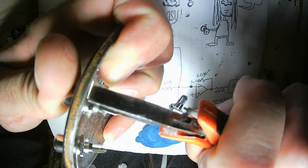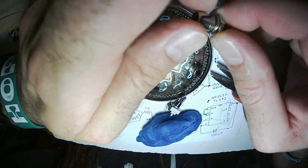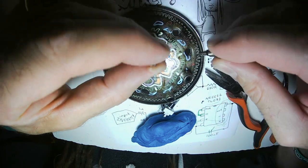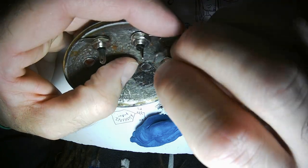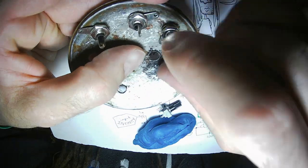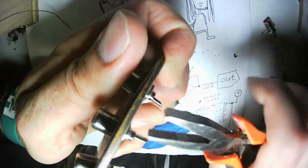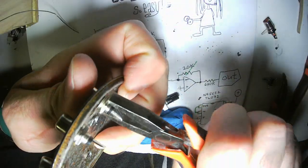Now, one of the cans I used three times was a pickled herring snack can. Those are made of aluminum, and aluminum is very thin and doesn't really work in the same way as steel. So when I put the jacks in the aluminum, it ended up being very loose, very quickly. The jacks kind of became wobbly. So I don't use aluminum anymore.